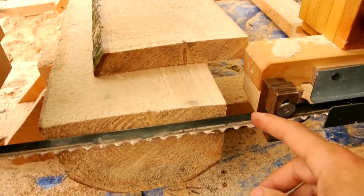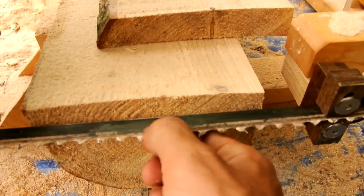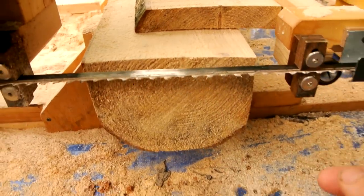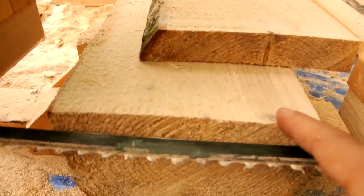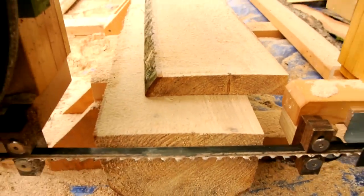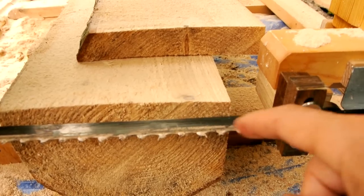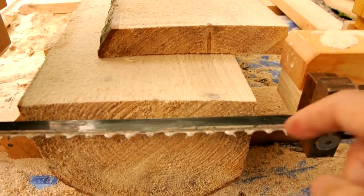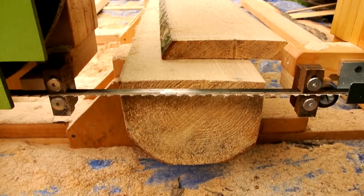The saw's really been struggling with the spruce here. The blade actually gets quite hot, and you can see it's gummed up a fair bit. This is after cutting about 4 cuts on this log. I get blade drift, and the guide bearing here gets really hot. So it's really not meant for spruce. I'd need some kind of thing to apply a drip to the blade to keep it lubricated. But I don't really intend to cut spruce with the saw, so I'm not even sure if I'm going to finish this log.